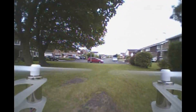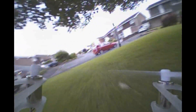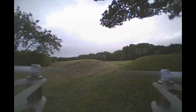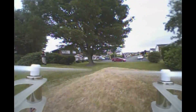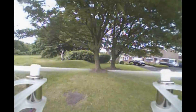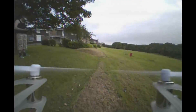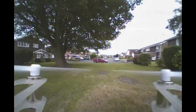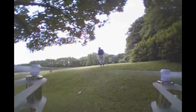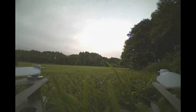This thing is just so good, and having those motors in shot — those arms — really allows you to know where the edge of the quadcopter is so you can thread the needle. It is really enjoyable to fly. I'm getting about a five-minute flight here. I just land at five minutes because there's no on-screen display. I'm sure it can fly longer than that — I just set my timer for five minutes to be safe — so there is a long flight time with these rolling spider props and the 750 milliamp battery.